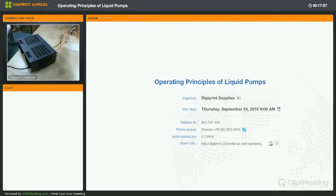Right, let's see how much we have. We have 250. So it's below specs. That's why the pump actually was replaced in the printer, because it wasn't feeding the secondary ink tanks fast enough anymore. All right. So that's a very fast way to test whether a diaphragm pump still lives up to the expectations.